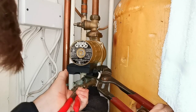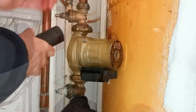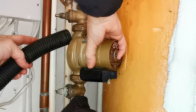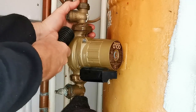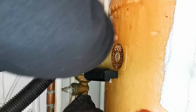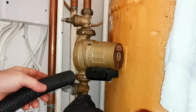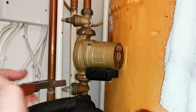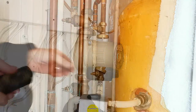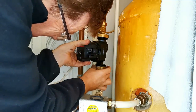The first job was on this pump here. Although I closed down both the valves really tight, when I came to remove the pump there was still lots of water coming out of one of the valves, and I couldn't remove the pump — I couldn't catch the water fast enough in a bowl and I couldn't use my water vacuum because there was just too much water coming out. So I had two options: one would be to drain the whole system, which I didn't want to do because that's going to take loads of time. The second option is to plug off the loft tank, which I'll show you how to do in detail. If you want to watch my video on how to change this pump then I'll leave a link in the description below.